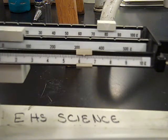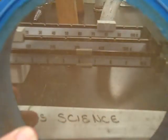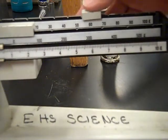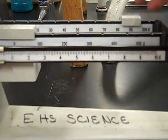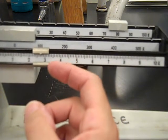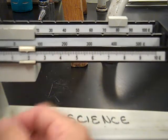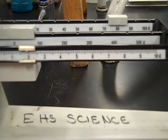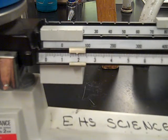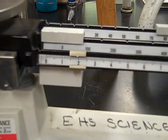The next smallest sieve, these are about half a millimeter. Okay, you can barely see through them. Empty has a mass of, if you write it back to zero, 70, 80, nope, 90 is too heavy, so it's got to be 80 something else. It's not quite to the 5, so we would go 81.94 grams for the third sieve.